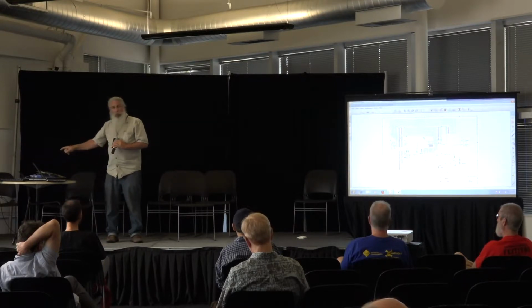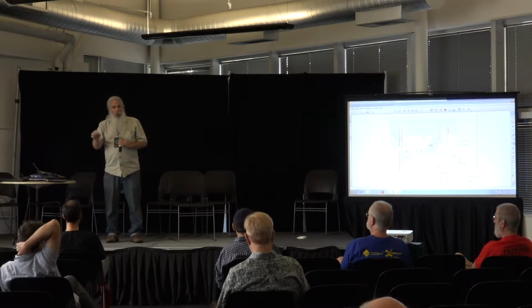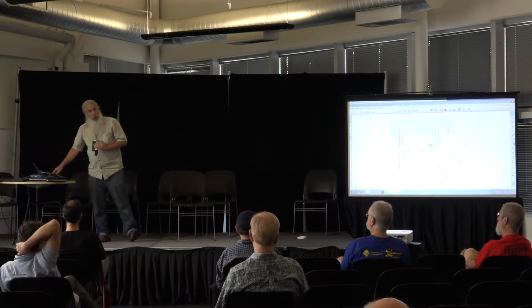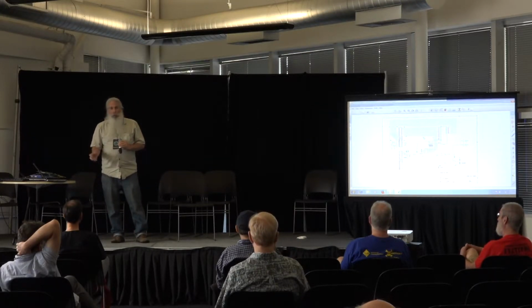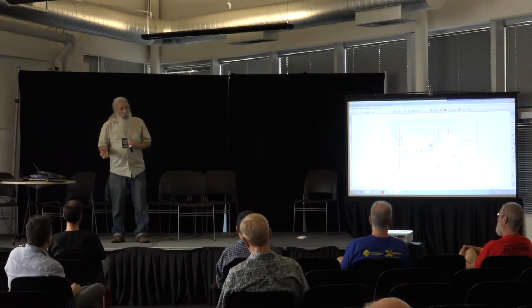And then it has a real simple blink routine. If you stop by my table, you can actually see it run. If there's a failure, it starts from the far side and steps across, and it does about a 1 second blink for each RAM. If there's a RAM failure, it does a really short blink, it just looks like a blip, where the failure is. So you can identify which RAM has failed, or possibly it could be the buffer chip that's tied to the output pin. But it allows you to very quickly identify where your failures are, and again, it's not using the RAM. Once you've verified you have RAM and the RAM is working, you can use it for other tests.